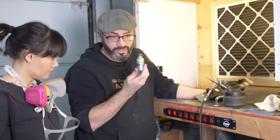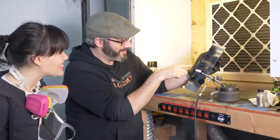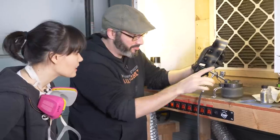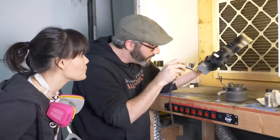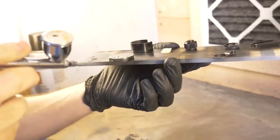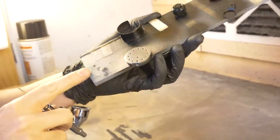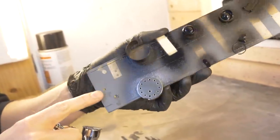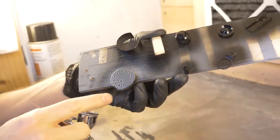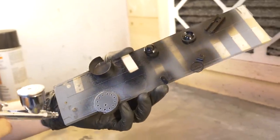The last step is our polished aluminum from Alclad Lacquer. This is like the magic trick. We have this glossy base coat, and then when we spray just a little bit of this on, it turns into metal. It's really cool. There we go. The gloss black is what really makes it shiny, which makes it sell as metal. That looks pretty amazing. Cool. So some parts are gonna get this, but the handle fins, those will stay black. Okay. Otherwise, let's paint everything else metal. Sweet.